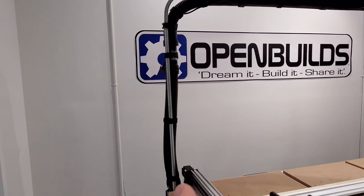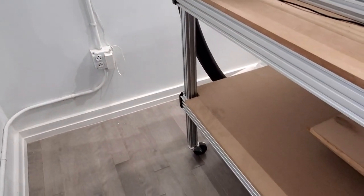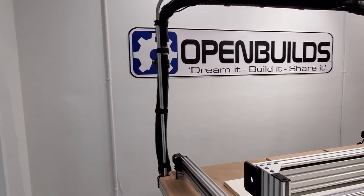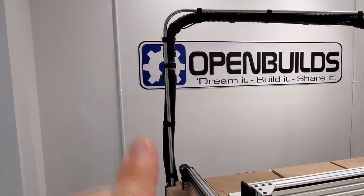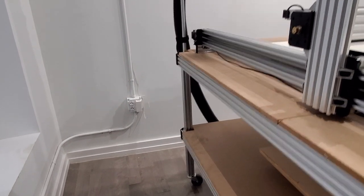What I did is I took the 10-foot stick and cut it down to 65 inches, then slid it all the way down until it hits the foot plate. Make sure you measure from the foot up to ensure you have enough ceiling clearance to tilt it in place and slide it down into the 40 by 40.